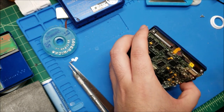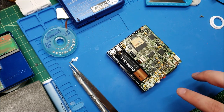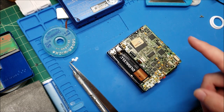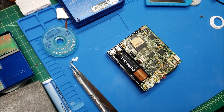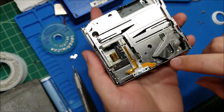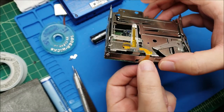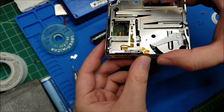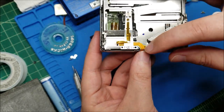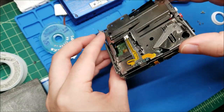The audio is fixed - it just had some dry solder joints. That might have been exacerbated by the fact that Sony put the amp chip right near a point of high mechanical stress from inserting and removing the jacks, so it basically just needed to be re-soldered. Now let's deal with the overwrite head - the ribbon is clearly ripped. So far we're two out of three - let's see if I can get the overwrite ribbon fixed and be three for three. You can see the ribbon was taped flat and broke right at the edge, exactly where you'd expect - between the metal frame parts where it bends.